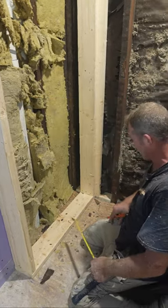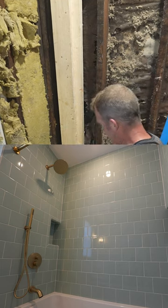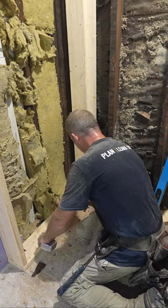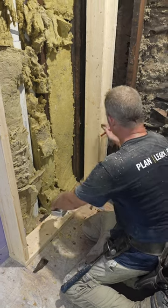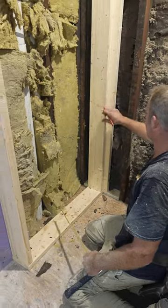16 is the center of where our faucet is, and I want to put a small niche on the side. I want to give myself enough room for my faucet, so I'm going to put another stud here. We'll make our niche about 10 inches wide. I'm going to leave the stud here, and then when we figure out the placement, we'll cut it — that'll be a recessed niche going in here.